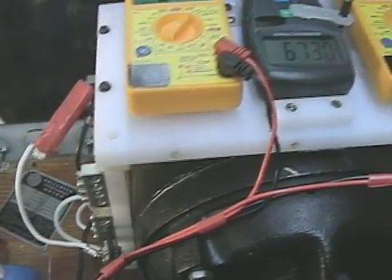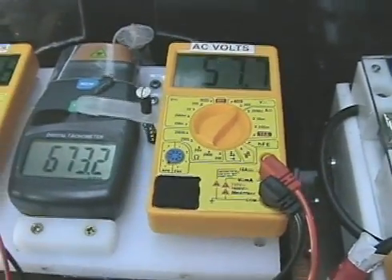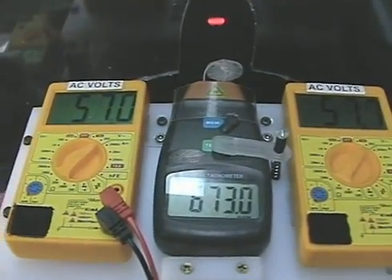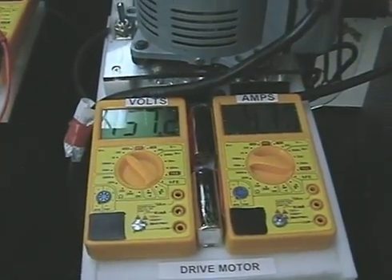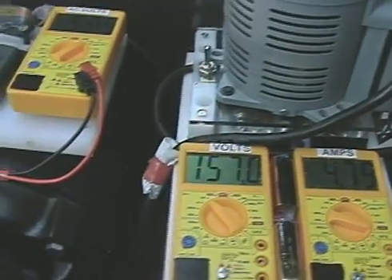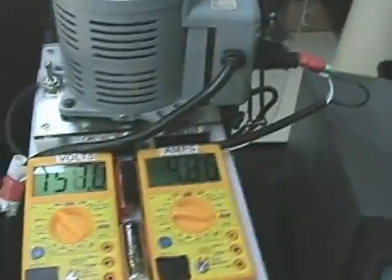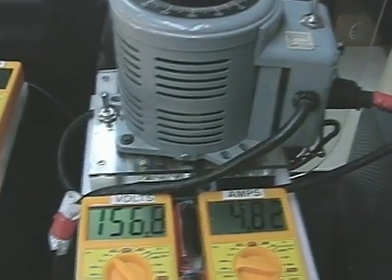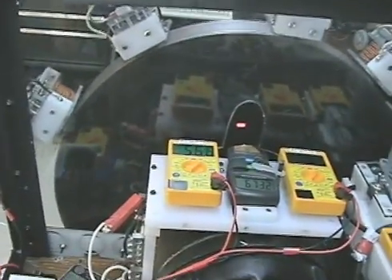I'm about to make some other changes which should make that smoother. At 673 RPM, I'm making 56 volts. I'm using 157 volts pulsed at 4 amps to do that, but I'm only drawing 120 off the house current. The caps are pulsing on the input because as it pulses, it adds a little extra pump to the capacity.